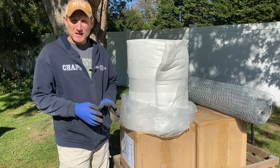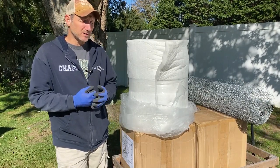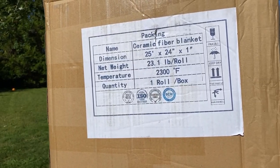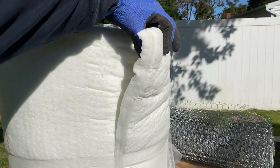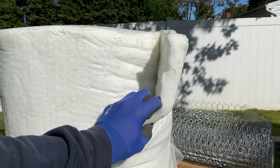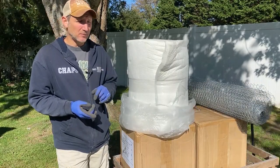Let me briefly explain the materials that I'm going to be using and the whole process that I'm going to go through in this video. This is ceramic fiber blanket. I bought 3 rolls of this. It's 1 inch thick by 24 inches wide and the length is 25 feet. For my size oven, I needed 3 rolls and I bought them on Amazon. I'll put the link in the description below.